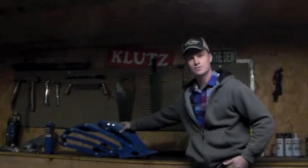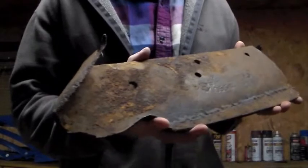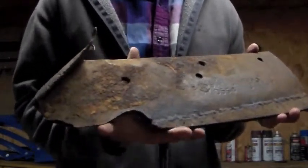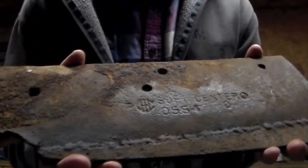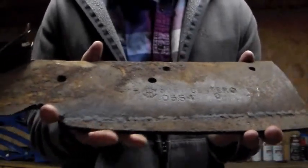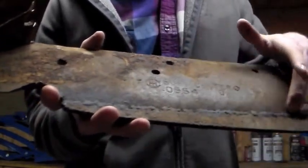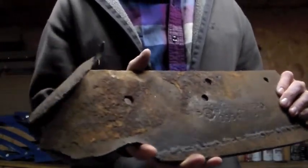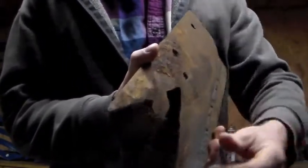The ones that were on here before are just too worn out to be used. Here's the old plowshare — as you can see, it's really worn out. It probably hit a big rock or something and bent it. It's actually an International Harvester off-center share. It's not even from the original plow bottom, which is fine. You can see it got worn out, and then the previous owner welded a new strip on to continue using it. So I think it'll be best at this point just to make a new one completely — that's just totally broken and rusted out.